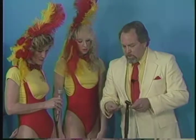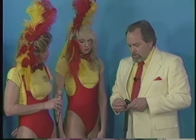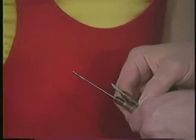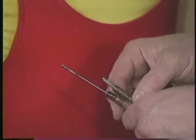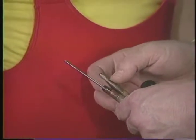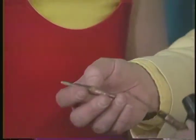The thing I wanted to say is that these little holders in here, you have to change holders for different sizes. I don't know if that will show in the camera shot, and Chuck, you'll have to let me know. Can we see that this electrode is much thicker, much larger in diameter? Is that visible? In order to go up to this one here, which we could use at 300 amps, 325 amps, you've got to have a larger diameter electrode, and that takes a different electrode holder, but it all screws into the same torch. And you're going to the larger one because now you're going to weld aluminum? No, I'm not going to the larger one. I'm just showing it. Oh, okay. Right. In other words, you're just changing the electrode.